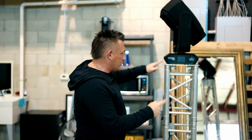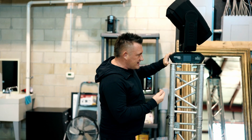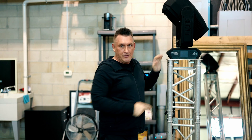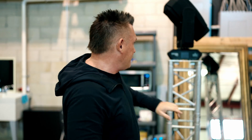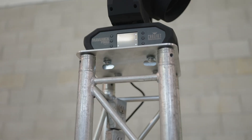After confirming all markings and holes were proper, we took our locking bolts, fed them through, and made sure they fit. We used four locking bolts per base plate per fixture, and added two washers per locking bolt. We fed two washers on top of each locking bolt, then sat the moving head on top of the plate and secured the base plate to the fixture. The two small washers gave us the proper spacing so the moving head fixture wouldn't move at all — keeping it nice and secure.